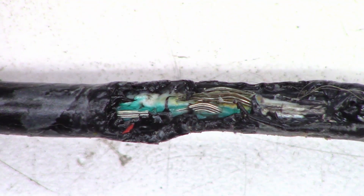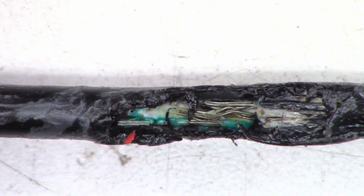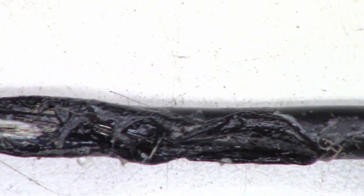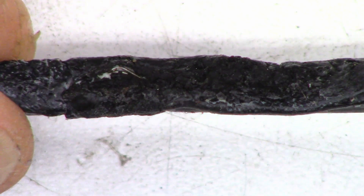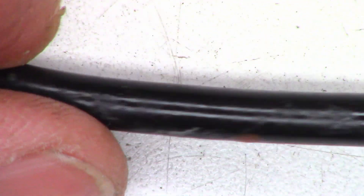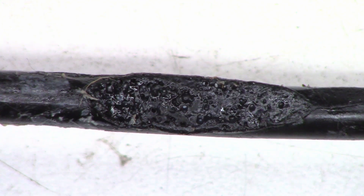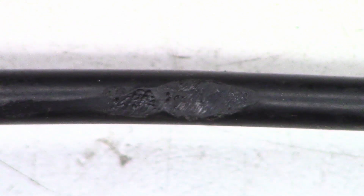The customer did have this wrapped up in tape. I went ahead and de-taped it so I could see the damage before I go any farther. I think what I'm going to do is just go ahead and lop this cord off, probably right back here where it's still good. And then I do see a melt spot with one lead, so I'm going to have to lop that portion off as well. And down here just a bit farther is another melted spot — these things do not get along with hot manifolds. The rest of the cord seems to be pretty good with the exception of one small spot — I think it'll be just fine.